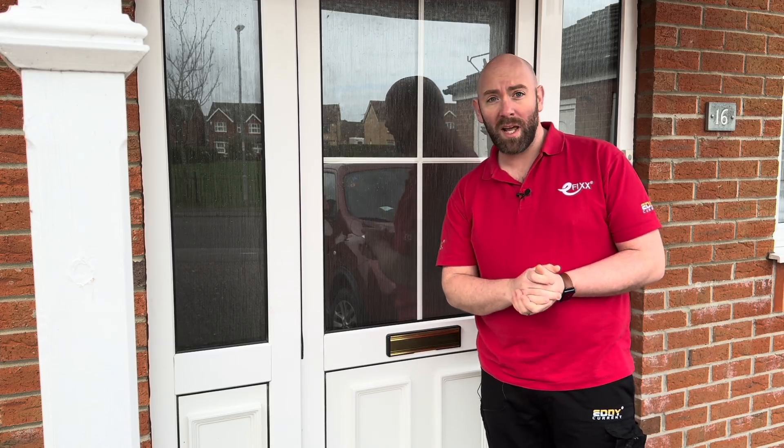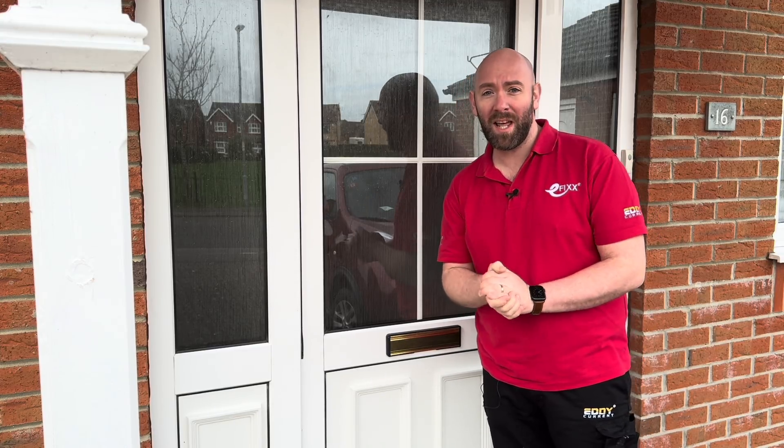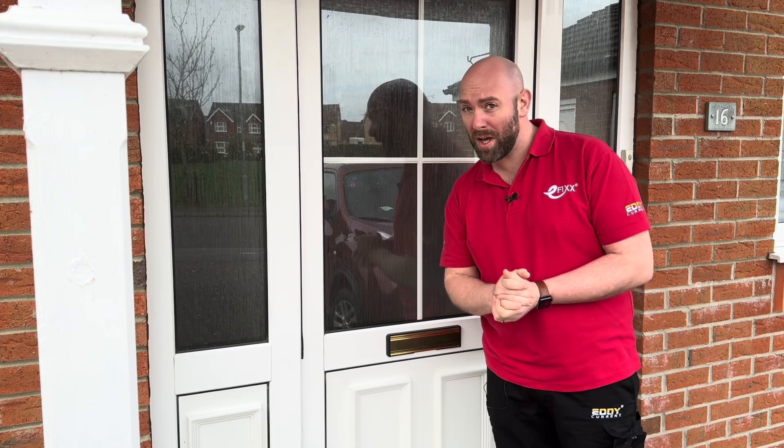In the previous video, we've been using test rigs from a beginner to a more advanced layout. But test rigs don't really reflect the real-life scenario often faced by learners, apprentices, and electricians. It's also important that we distinguish between the two types of tests that electricians carry out: Electrical Installation Certificates, which are for new builds and ensure the property is safe to go into service, or the Electrical Installation Condition Report (EICR), which is to make sure the electrical installation is safe to remain in service.